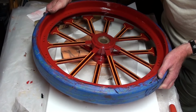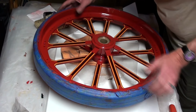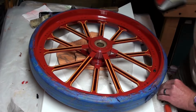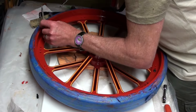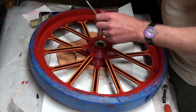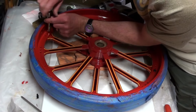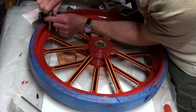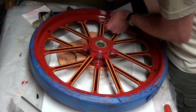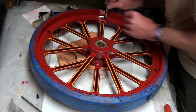The rim was then placed on the hub assembly and temporary bolts attached to join the assemblies together. The tape markings made it very easy to correctly align the spokes to the hub in the same arrangement as the initial assembly. Bolts were only attached in the outer two of the three holes in the spokes. Once tightened all around, the special rivet bolts were inserted and tapped home in the center holes. Machine nuts are included to secure the special bolts. Before tightening, permanent high-strength adhesive, also included, was applied to the nuts.